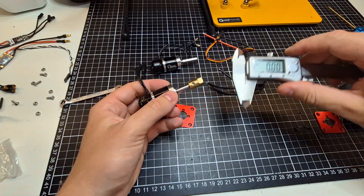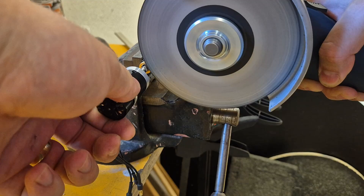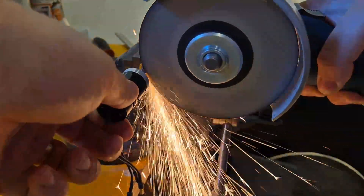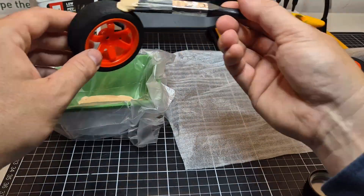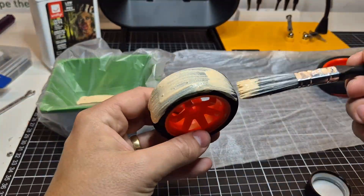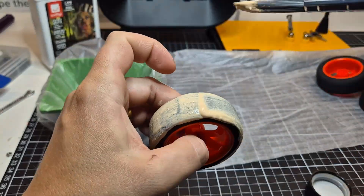For the drive system, I used two Megasparks motors from Fingertech Robotics, which combine a planetary gearbox and a brushless DC motor for compact power. Standard RC plastic wheels with foam tires coated with liquid latex improve grip and absorb impact.